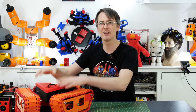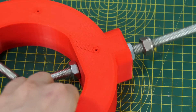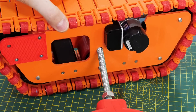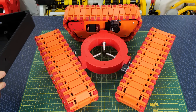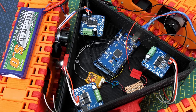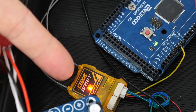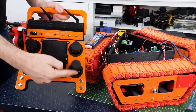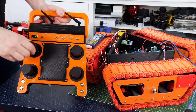Right, let's get this together and see how well it works. The tracks are going to be attached to this middle part, which is basically a big 3D print with some 10mm studding that allows each of the tracks to pivot, going through a hole through both sides of the track sections. In the middle there's a tray for electronics consisting of an Arduino Mega and three motor drivers. I've also got an orange RC receiver so I can use the RC transmitter I made, which is a DSM2 transmitter with various sticks that are three axes each and various switches.